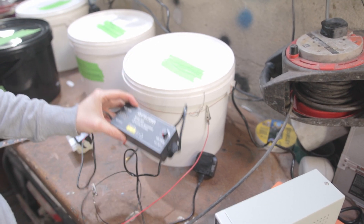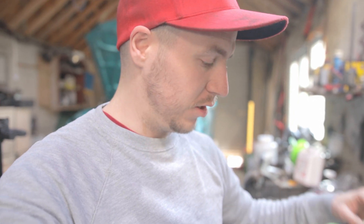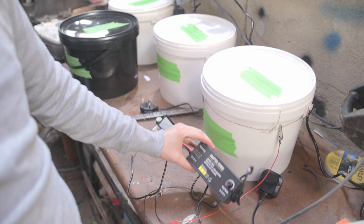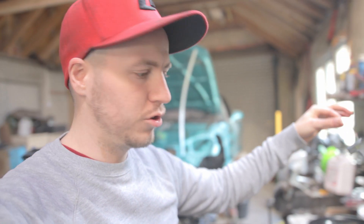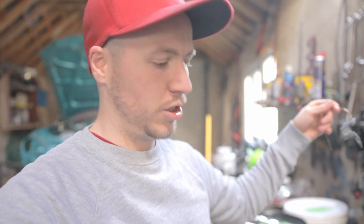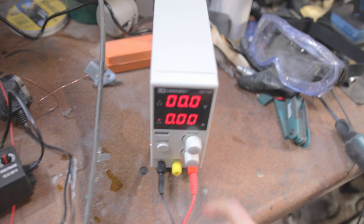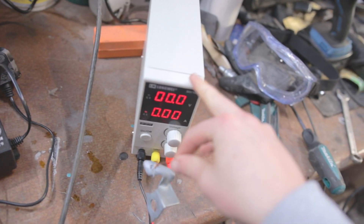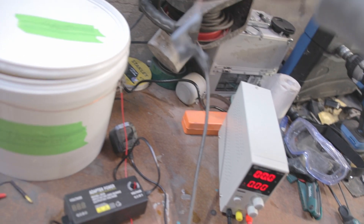It's the next day. I had to stop because the power adapter wasn't going low enough - the amps for the electroplating were way too high and I couldn't adjust the voltage low enough. When I put the metal in it was just burning the zinc onto the piece so it wasn't getting shiny. I now have a new power adapter which lets you adjust both volts and amps, so we'll have a lot more control. Hopefully this time we'll get a nice zinc plate finish.